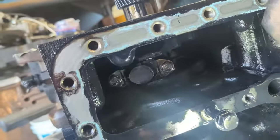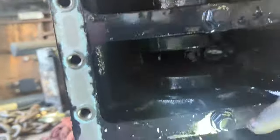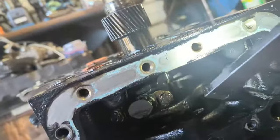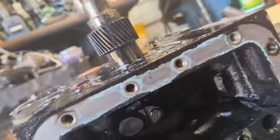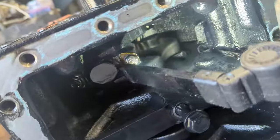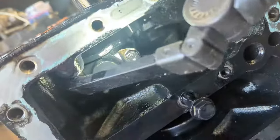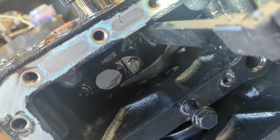So next, we're going to remove the crank rods, and all they are is two bolts on each one of them. You can also rotate the crankshaft around so that it's easier to remove. What I suggest doing is first have it probably like this, or pretty much as close to you as possible. Take off those two bolts on this end and this end, and then rotate it 90 degrees. That way you have clearance for the piston rod.